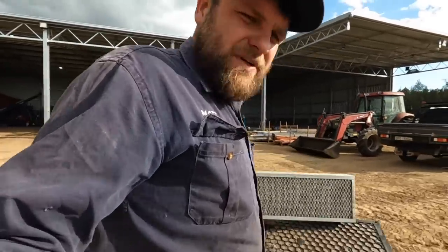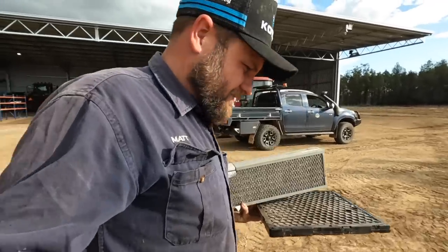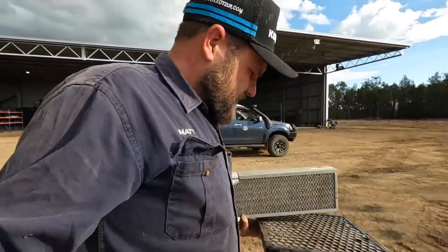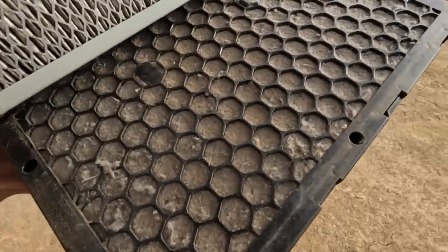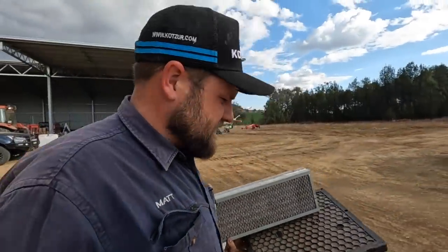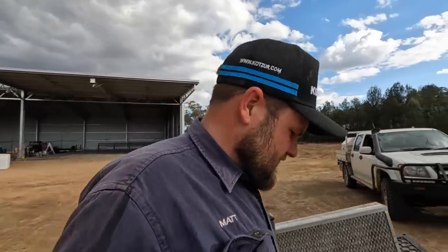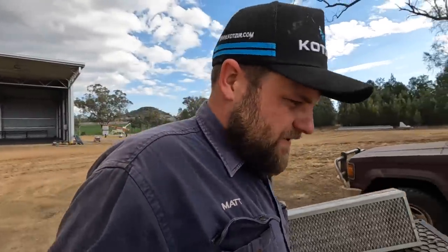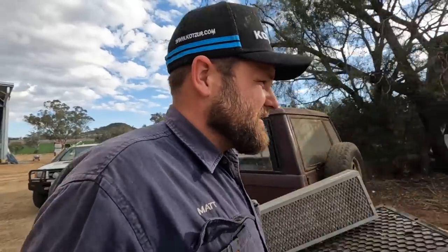8, 23. Well, I'm armed with the cabin filters. So this big long one is for the outside, so it obviously gets really dirty and dusty. And this one here looks like the lint filter out of a dryer. Yeah, that's the recirculate filter. So very important, because that is what stops the evaporator from getting clogged up.